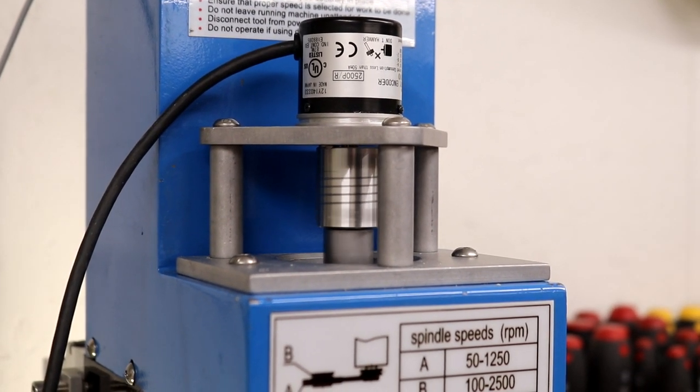Why use the motor's encoder? Isn't a spindle-mounted encoder better? An encoder measures the rotational position of the spindle and is needed for rigid tapping, which requires synchronizing the Z-axis with the spindle — any error in the threads means they're misformed or the tap breaks. Encoder pass-through from the drive is available regardless of control mode. Both the pulses per revolution and encoder pass-through have configurable scaling factors. I configured 512 pulses per revolution so the native encoder count is divisible without a remainder. A spindle-mounted encoder is ideal because the spindle is rigidly attached to the tool, however it's a pain when changing tools because it likely will interfere. A servo motor already has an encoder and some drives pass the encoder signals through, like the Dyn4, after performing a configured scaling.